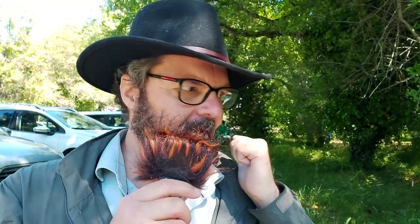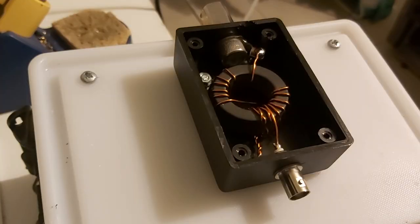We are vertically polarized on the six half wave wire, so about 2.85 meter wire, and horizontally polarized on that very very low slung dipole, about a foot and a half from the ground, that's hanging there. So cross polarized, that's probably not good. But anyway, the 49:1 does get more needle deflection, so that's what I'm going to use, and I'm going to put it in the box. And now it's in the box.